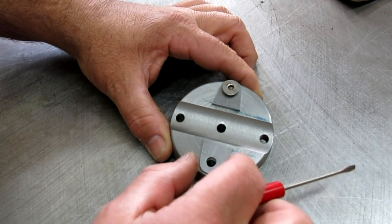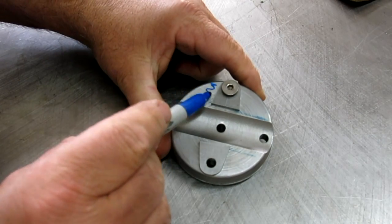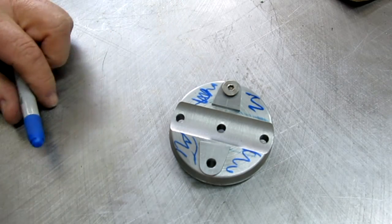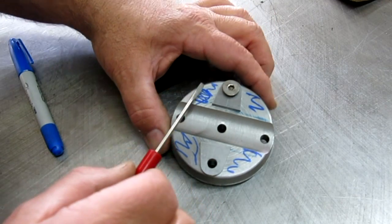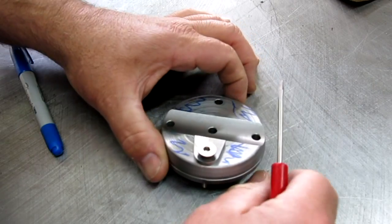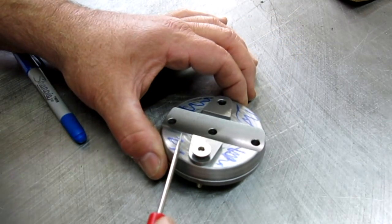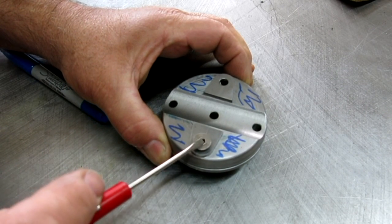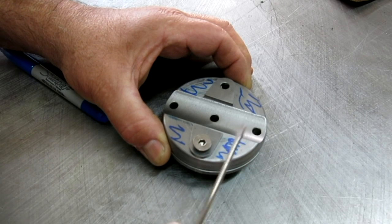Let's take a look at what that actually means. Basically what we would be doing is removing all this material around the tab down to this level here. You can see that those surfaces are at an angle, which isn't really a problem, but you'd have to set it up on a rotary table to mill that angle. You can rotate it 180 degrees and get the same angle on the other side, so you've got at least four different angle setups to do to catch those sides.